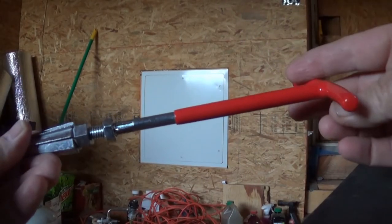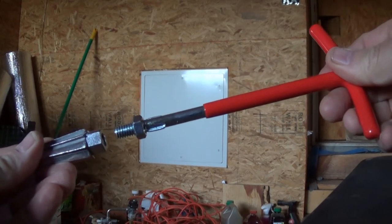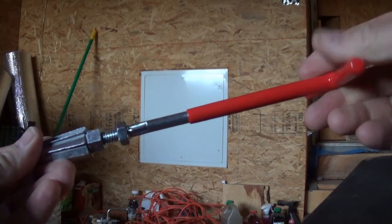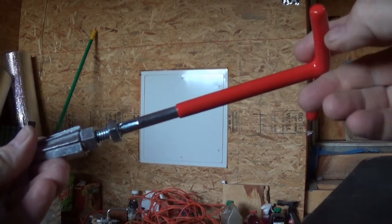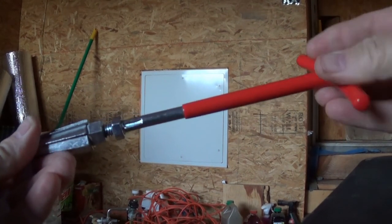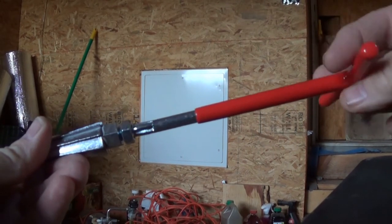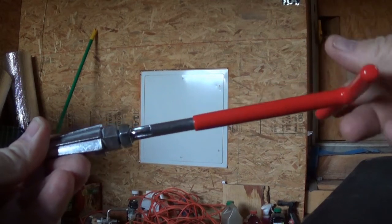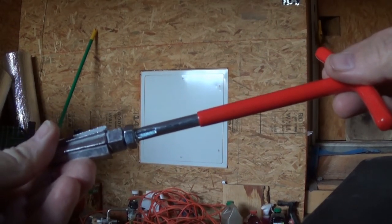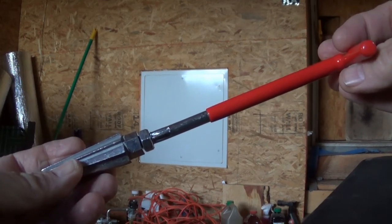This here would normally be clockwise, like you're putting a screw in, and it actually comes out. This is normally counterclockwise, like you're taking a screw out, and you see how it's going in, which is kind of what you want, because then as you try to back out that plug that's in there, you want this to tighten and not loosen. So it's good as reverse threads.